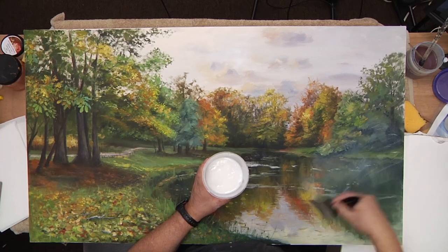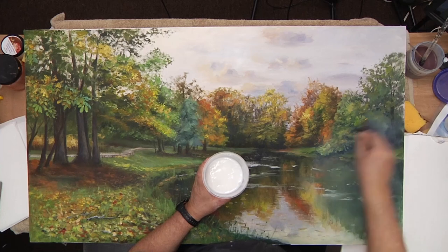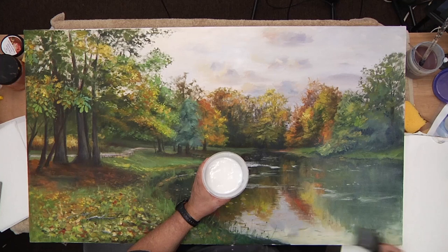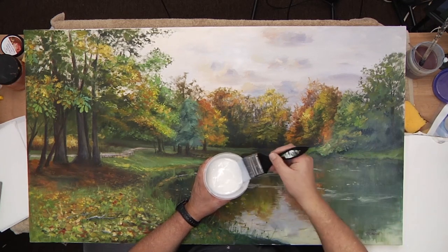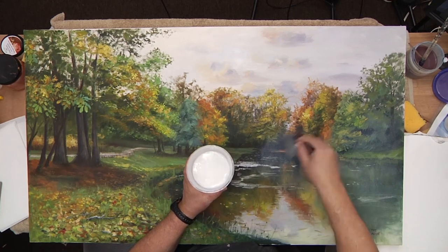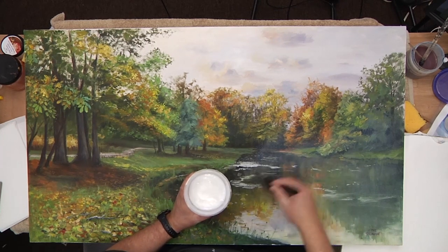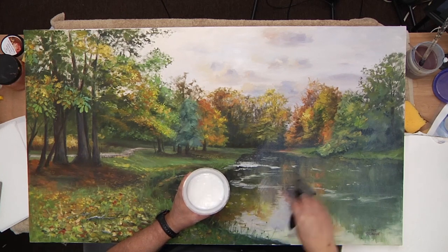I work it in small X motions like this. And I start to just stretch this varnish out, and stretch it and stretch it. It will eventually go absolutely clear if you're stretching it out. But this is what I like to do. Work it so you don't put on a whole bunch of varnish all at one time. You're stretching it out and working it here.